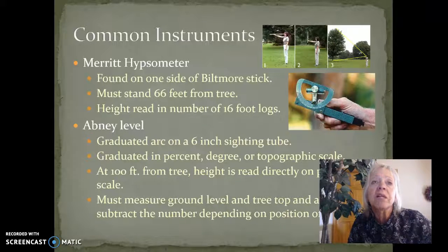The second instrument is an Abney level, which is used in surveying. You look through that sighting tube and find the bubble — like the bubble on a level. As soon as you get to the top of the tree, you take a measurement, then you get to the bottom of the tree and measure it, and you add those together or subtract them depending on whether they're positive or negative.